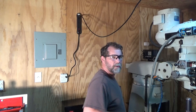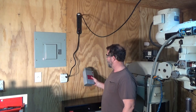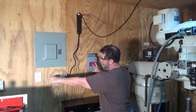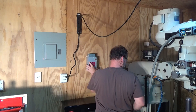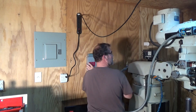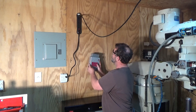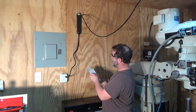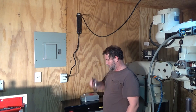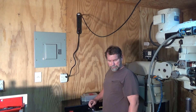All right, here we go. Welcome back to the shop. Today I'm going to wire up this static phase converter. The plan is to come out of this 220 outlet with SO cord, and then come from the phase converter. Already got the cable in the seal tight, out of the phase converter, into the three-phase motor. We'll be doing that today. Just got to put a couple of STACONs on there — it's relatively simple to wire this thing up — and hopefully we'll get it going. It's quite the challenge getting a machine home and sitting there a week, only going on somebody's word whether it actually runs or not.